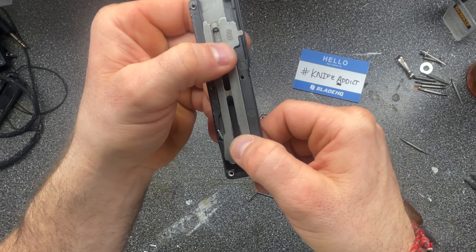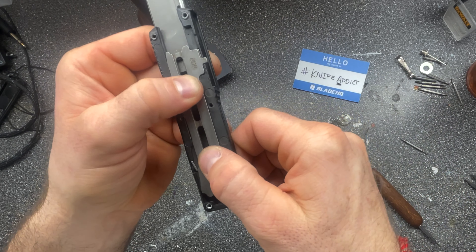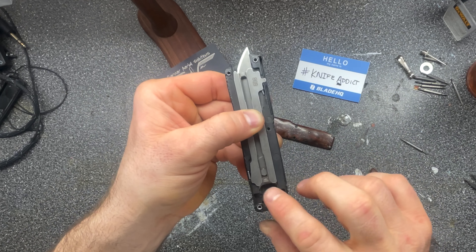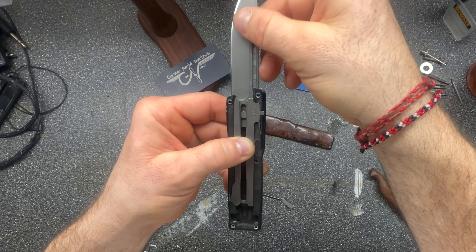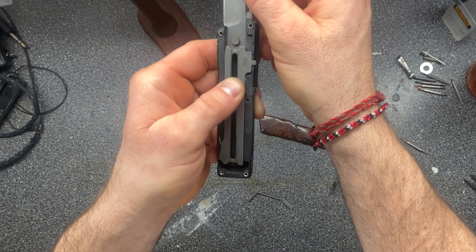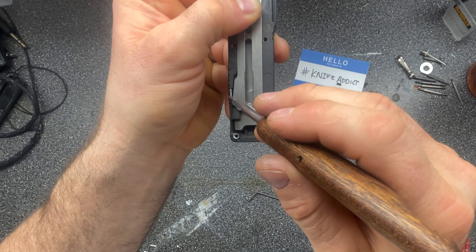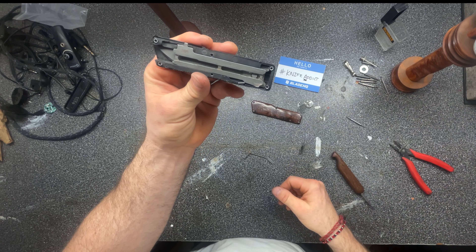On the south side over here on the bottom, those are made to — watch here — as I push the slide forward it engages the lower stop pin. Same thing for the top: you see how this top side, that recessed side underneath — same thing. With the angle, both sides will engage and free up the lock pin. So if I hold it here I can slide the blade back in or back out. If it goes far enough — there we go. So now we are locked out. If we pull the slide back it frees up that pin, lets the blade slide down. The spring direction lets the blade go past that stop pin and holds it in, and then the reverse is true if we press the slide up — it moves that stop pin and frees the blade to move to the outside.